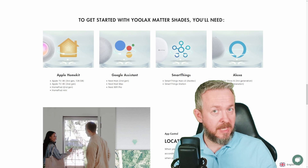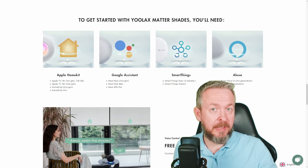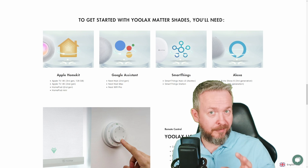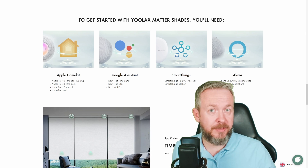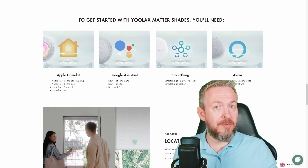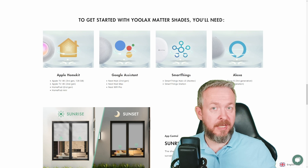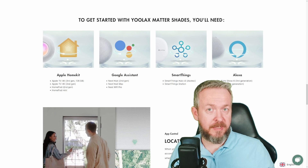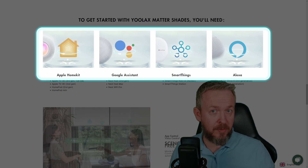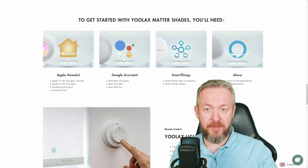Let's talk about Matter. Some of you will frown upon the Matter support, but actually Matter is slowly maturing, and this product is a great example of it. At the beginning of my testing, I didn't have Matter support in Home Assistant. Now I have both Matter and Matter over Thread, because this device is actually using Thread and it needs an OpenThread Border Router (OTBR). Both Matter and Thread are getting easier and easier to set up in Home Assistant, with more supported devices, more coordinators, and more ways of connecting. If you're not using Home Assistant, supported ecosystems include Apple HomeKit, Google Assistant, SmartThings, and Alexa.